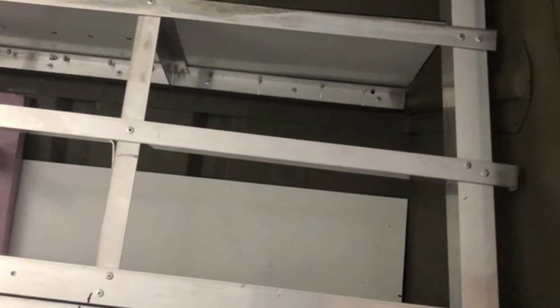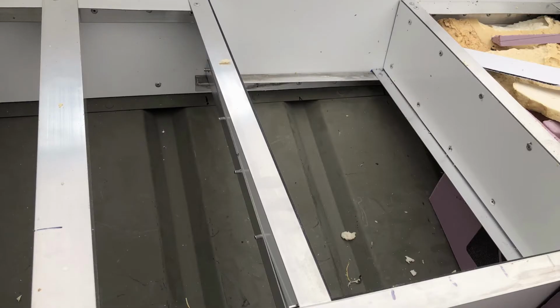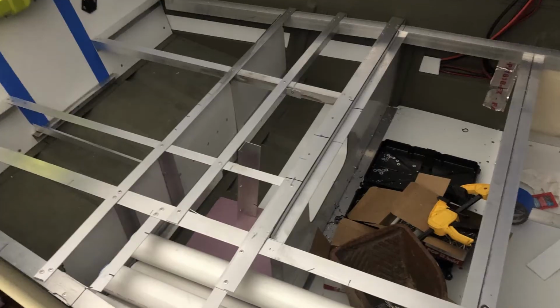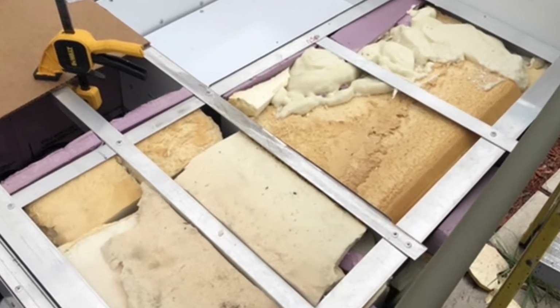There are a minimal number of rivets attached directly to the outer hull. Attachment points typically are to the hull's ribs. A pocket is created in the foredeck to recess the trolling motor pedal. All forward areas of the foredeck that are not lockers are filled with flotation foam.